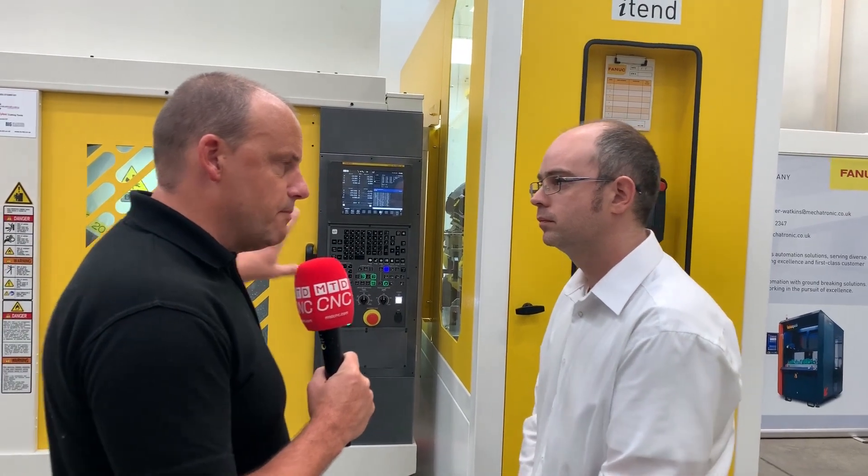A quick word on BBT30 — from your experience in trying to progress BBT30, not just yourself but other machine tool companies, how capable is that spindle? For a 30-taper spindle, the addition of a BBT interface almost puts the gauge diameter of the tool up to a BT40, so you're getting that rigidity. If you're going to use the power of the machine for heavy stock removal with big engagements and heavy trochoidal paths, then the BBT30 option is perfect — it gives that additional stiffness to the spindle. Two things here: great machine, and great automation with it. Thank you very much, Andrew.